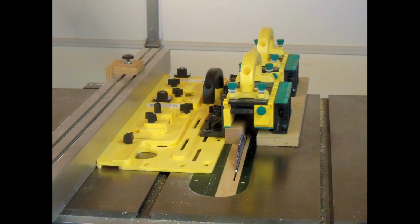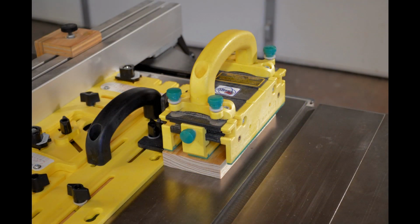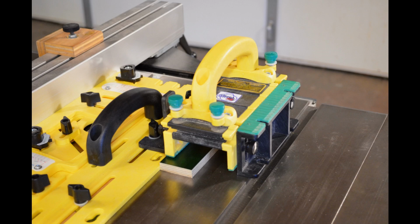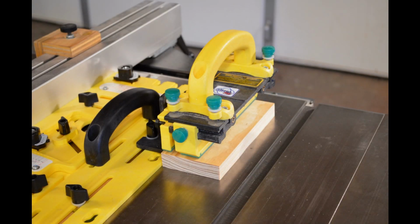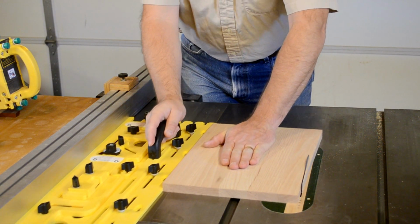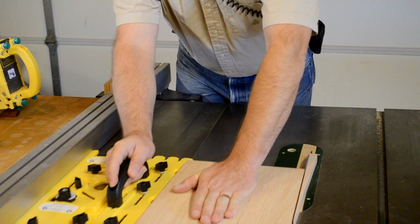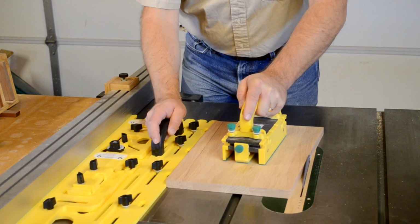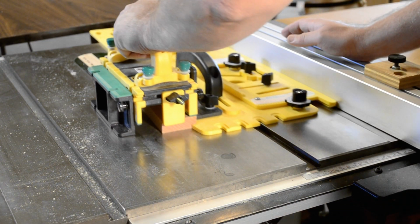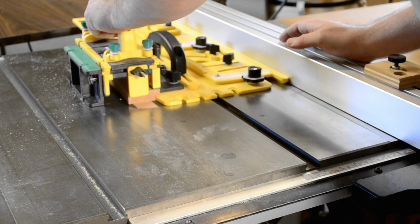While it would be impossible to show how to configure your taper jig for every possible cut you may need, we want to demonstrate some of the many configurations available to help you plan safe and accurate cutting with your MICRODIAL taper jig. For larger pieces, keep it simple. Just set the jig and keep your part tight to the jig with your free hand, or of course you can use a gripper. Smaller and narrower parts will require some safe method of holding them to the jig.